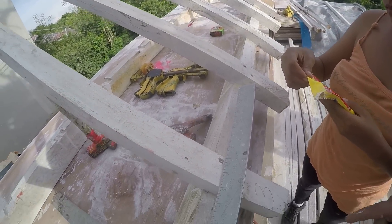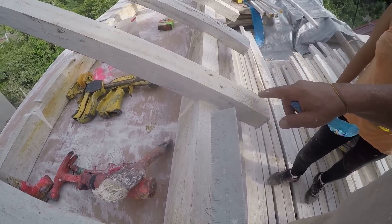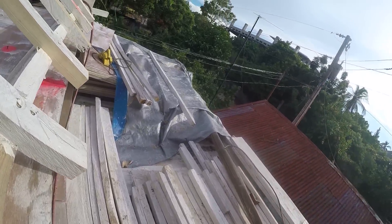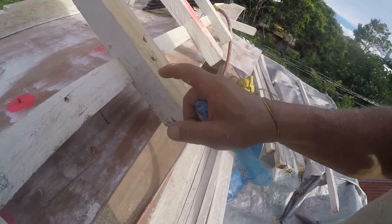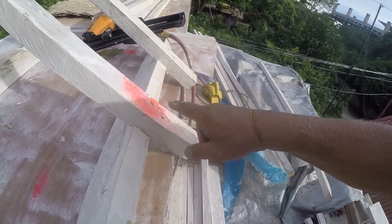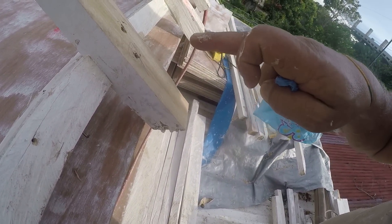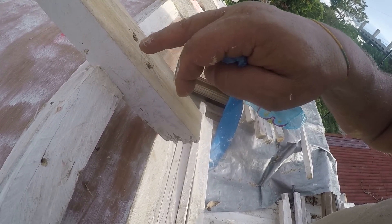I just built this 12-foot ladder with one-foot rungs. We had to actually mill down the lumber in many places — you can see it's milled over here. I made all the slats two and an eighth, but some of these boards were two and a quarter or two and three-eighths by two and a quarter, so I kept the heights the same. Now I'm putting some outside waterproof glue on and giving it three nails — one on an angle like this, one on an angle like that, and one on an angle like that.